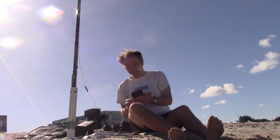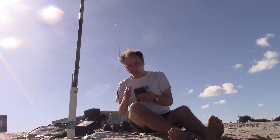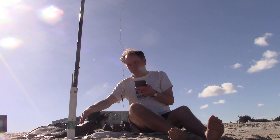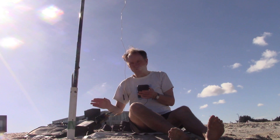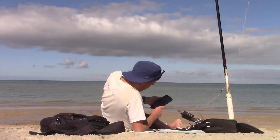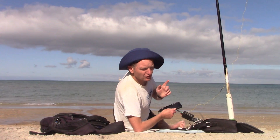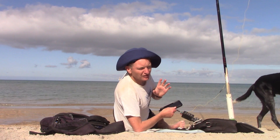Just on 18 MHz and completed a contact with VK2SG. In case you're wondering, I'm using the FT8CN Android app — that just needs a simple cable into an SSB transceiver with VOX and that allows transmission and reception of FT8. So far we've had one VK2 and two into Indonesia: first two on 17 meters, most recent on 15.